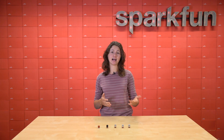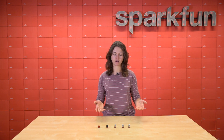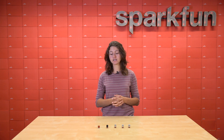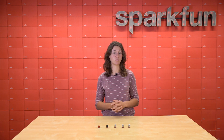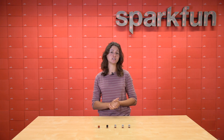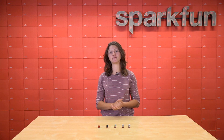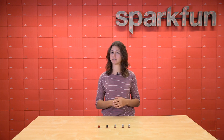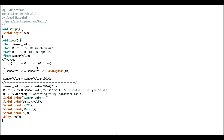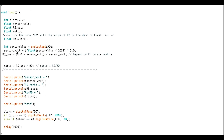Each of these sensors needs to be calibrated in order to get accurate readings, and the process is pretty translatable across all the sensors. First, it's important to plug it into a power supply and let it preheat for 24 to 48 hours. These sensors get gas concentrations based off of resistance ratio, so you'll need to get a fixed value for the sensor resistance in order to calibrate it. It's easy to do this through Arduino with the following code — it averages from 100 data points such that there is a stable value, and then measures the sensor voltage, which helps determine the sensor resistance.